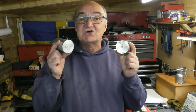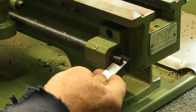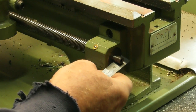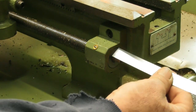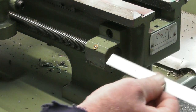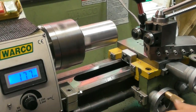One of my viewers sent me two big chunks of aluminium a couple of weeks ago and we've found a use for one of them. The thrust bearing diameter looks around 23mm, so I'm going to do a 22mm plain diameter over a length of about 35mm, with an M8 bore through the centre.